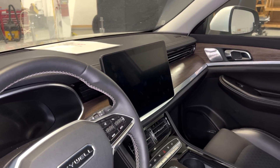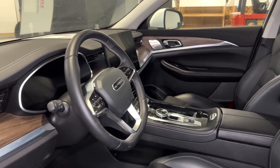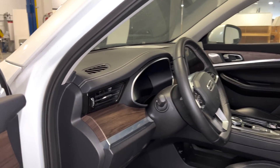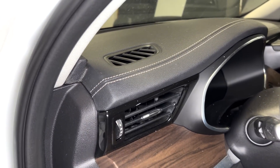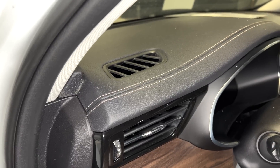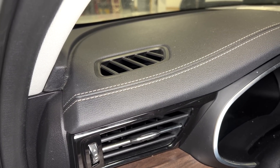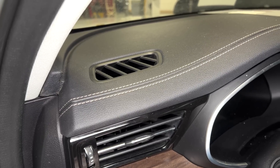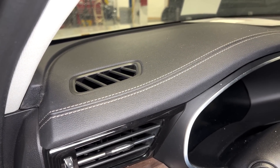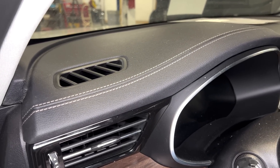For me, I'm looking at what type of machinery, what type of labor, what are my process steps to make each and every different one of those finishes? Let's get a real close look at that instrument panel. I want you to look at the stitching on the panel. You will see the very center groove actually is not a sewn seam. This is a thermoform skin that is stitched over top of its thermoforming. So the join seam, which would be in the center, is not a real seam. This is thermoform sewn, and then more than likely it is a poured-in foam behind it after it's joined to the substrate. So I'm looking at very expensive tools — basically three very expensive types of tools in order to make that assembly.